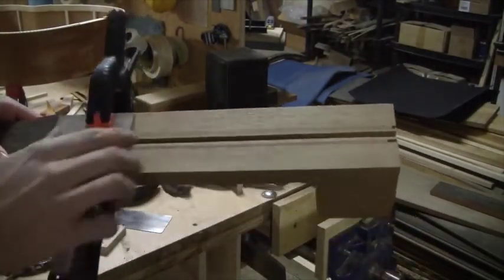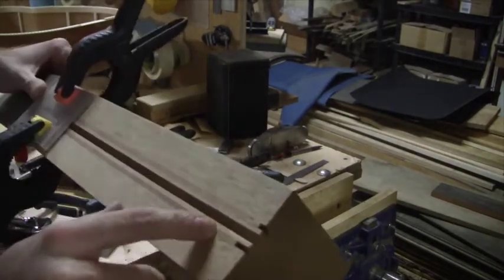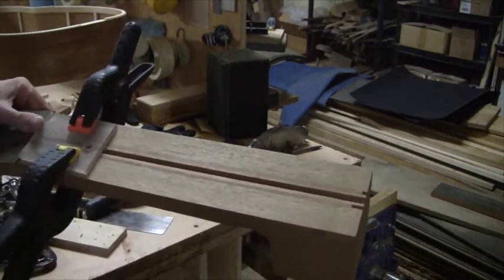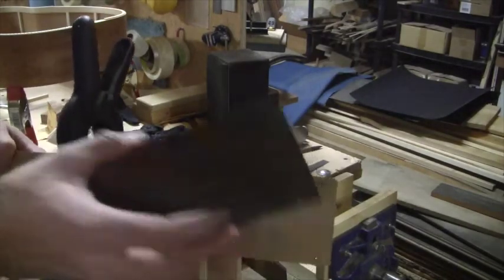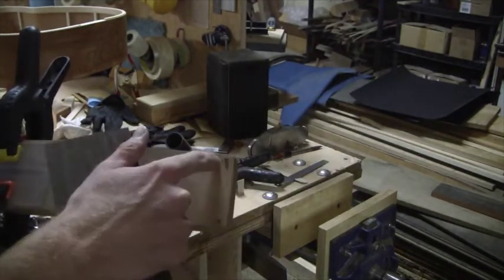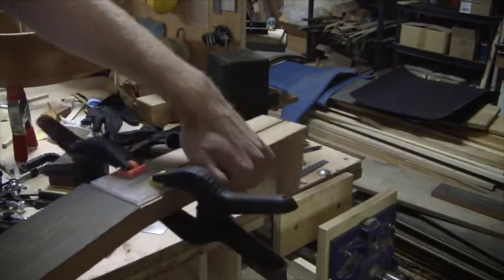Okay, so in the last clip, I glued in the carbon fiber. I put these filler strips on the top, and now that the filler strips are leveled, there's just a very, very thin piece of wood now covering up the carbon fiber so that I still have the gluing surface for my fretboard. And the final stage that I'm going to show for the neck in this video clip is gluing on the head plate. I have my Ziricote head plate here, and just a couple metal reference pins drilled in the headstock. So just need to apply some glue, line everything up, and clamp it down.